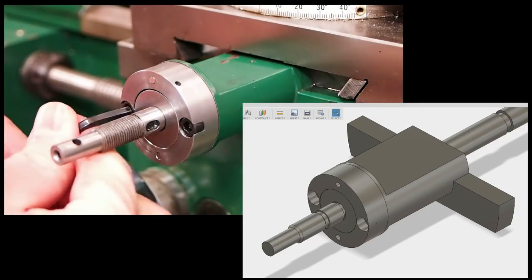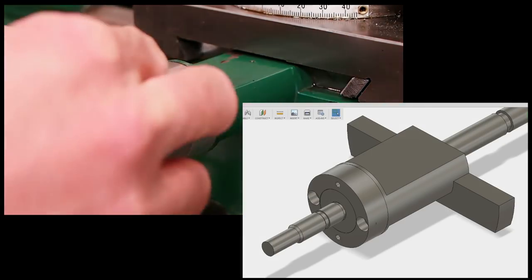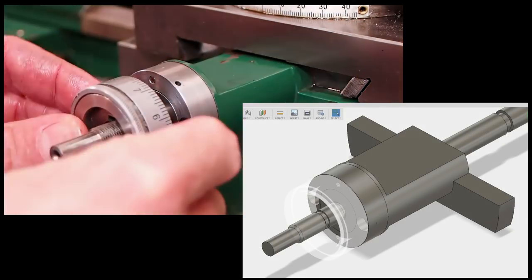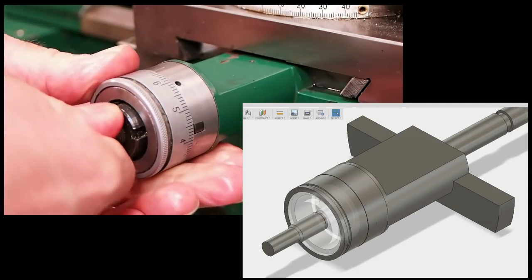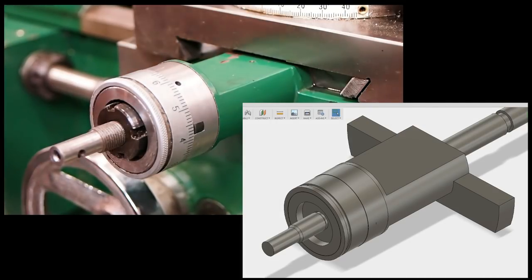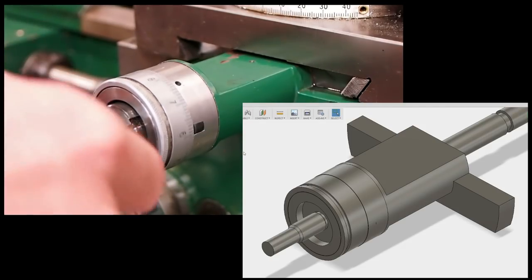The existing collar, dial, and nuts were used. Care must be taken upon assembly to ensure that you don't overload the ball bearing. Tightening the nuts too much will induce too much preload, significantly reducing bearing life. The good news is, even good quality bearings in this size are very reasonable. So now let's take a look and see how I made it.